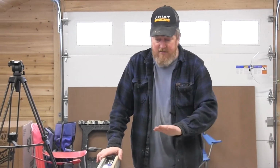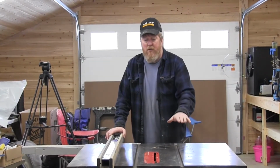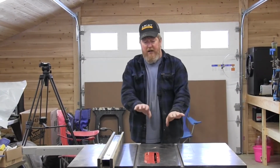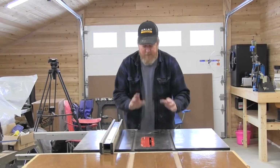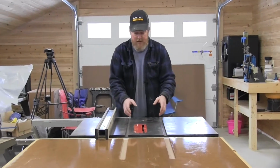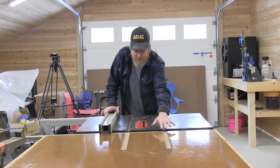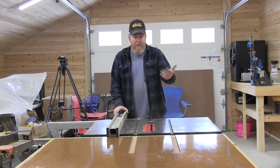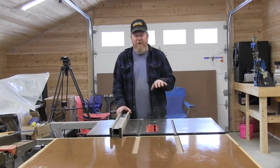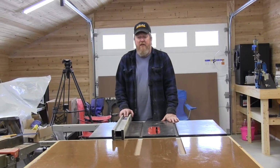We're going to get the table saw how we want it. Everything's level. We basically made the outfeed table about 1/8 of an inch lower than the table saw so that things won't catch. We also plowed grooves in the outfeed table so that when we build our sleds for cross-cutting, they have some place to slide without catching or binding. We did make them extra wide, so there will be no binding. And yeah, I think that's it. We'll probably put a bench vise on it. I don't know if we'll ever put any T-track in it. Don't really see that at the moment, but who knows.